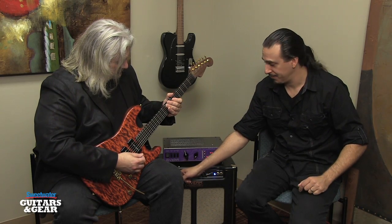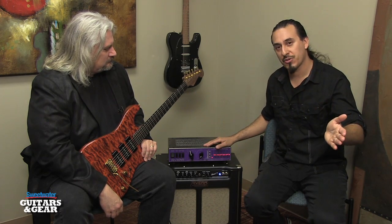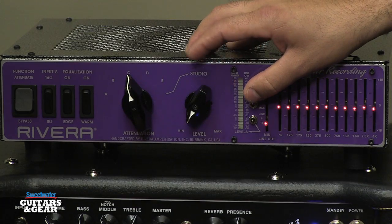I'm going to give it a little bit of gain so you can hear a little overdrive. So you heard the T75 variation, the T75 character shape. Now I'm going to show you: you get the Rock Crusher Recording at home and it's going to be flat — you don't know your shapes. Well, the tone controls are extremely musical and very intuitive. I like to use Ross Hogarth's quote — he's a producer/engineer who recently borrowed one for a big record. He said you can turn any marginal-sounding amplifier into an extraordinary amplifier, because you can basically flip its character altogether. You can have a little blues amplifier, scoop out the mids, bump up the bottom end, and get a monster-sounding amp you'd think is a 100-watt stack. So here is what a normal line out from your amp sounds like — it's completely awful. We're going to engage the EQ, set it on flat, and right off the bat you're going to hear a dramatic difference.